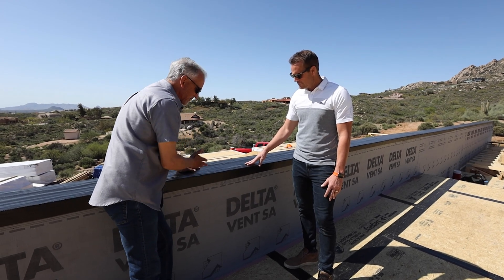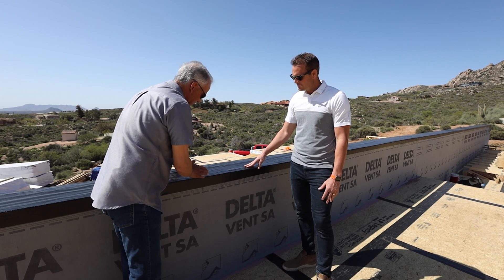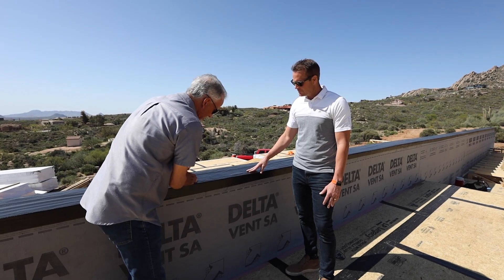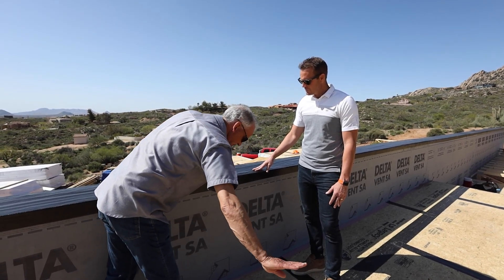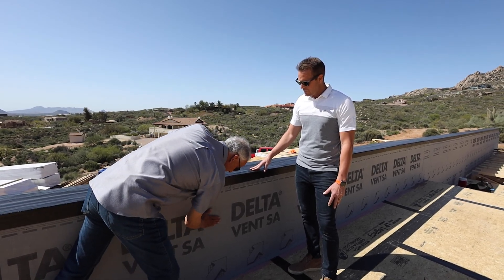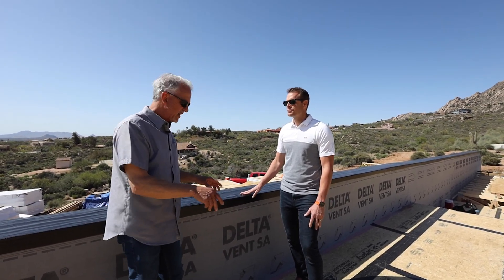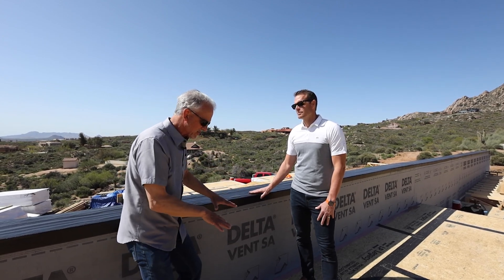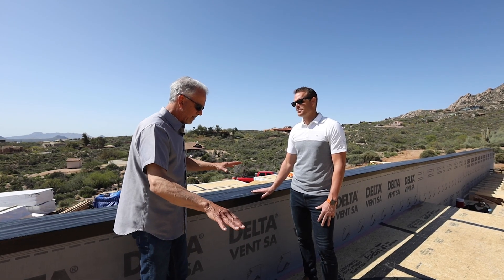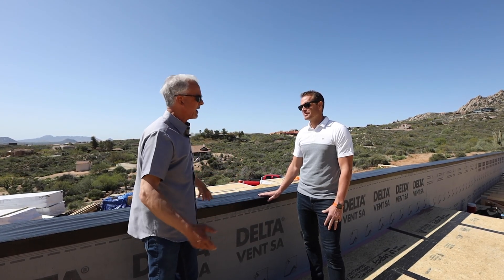On the top of the wall — the parapet, basically an ICF parapet — we put a really nice big 18-inch wide membrane that goes over the top and onto the weather barrier, so everything is shingle fashioned to drain out. When the SIPs come up, the structurally insulated panel will come up about 12 inches, and we'll make sure to flash onto the SIP panel. A TPO roof will go on that, but this just gives us a layer of added protection. Any water that ever gets through the system — and we hope it never does — gets to a location that is incredibly durable and can handle a little moisture from one storm or another.